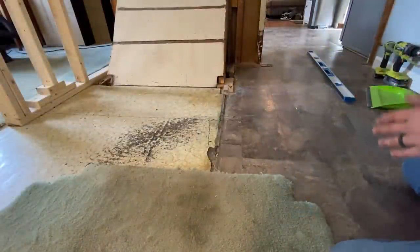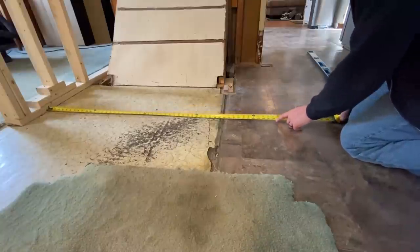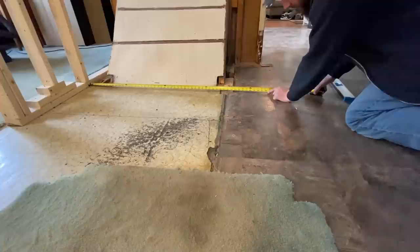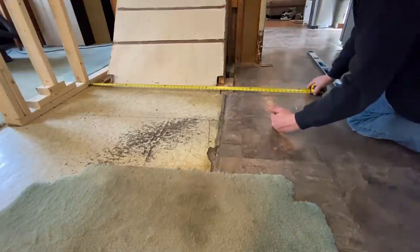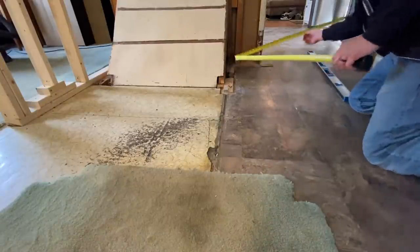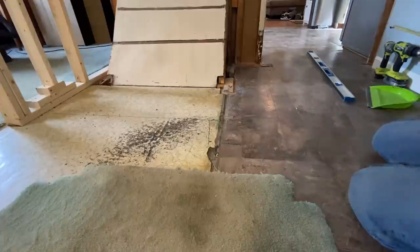So when you're working on an old house, sometimes you have to make decisions based on what you feel is right. And what I'm gonna do is look at this line. This says 52 1/8. If this wasn't here, I could measure right to the end there, but I'll measure off that wall. This says 52 1/4, a little more than a quarter. So this is already telling me what I thought was true, where this line should be pushed this way a little bit. You can also measure off the opposite, which is 36. And then this is 34 1/2. So this wall is really crooked.